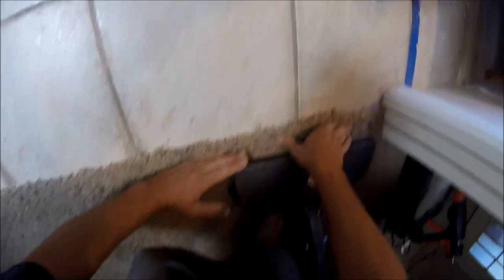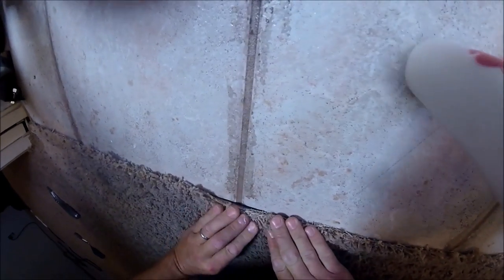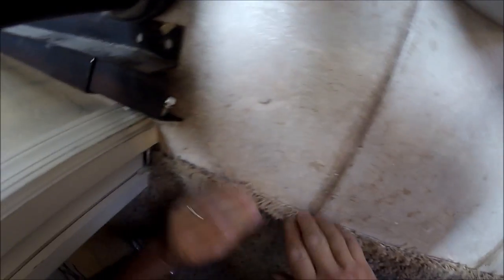I'll let you see the process of trimming it and tucking it, and see how it turns out once I get done. This is pretty important because you do see that quite common in carpet. This other doorway is actually the same way. There's a wrinkle here because I already stretched this room the other way — I started on that side and came this way, so that's why I chose to do that side first because I was pulling away from this wrinkle. Now I've got plenty to work with to fix this doorway here.